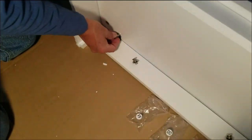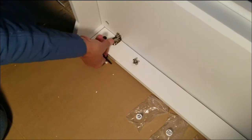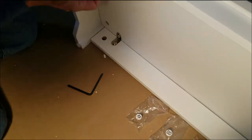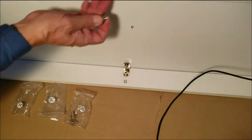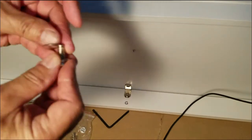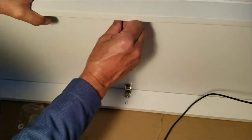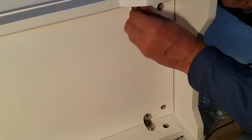Now let's work on those bottom braces. Remember those L brackets you installed previously — that's what you're going to tighten down at this point. Use the instructions; they'll tell you exactly what bolts, washers, flat washers, and lock washers to use. Always use the flat washer on the part of the screw closest to the surface you are tightening down upon, and then use the lock washer above the flat washer to keep that screw tight for a long time.